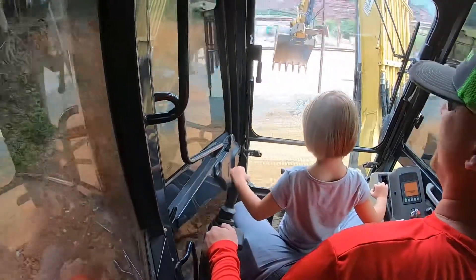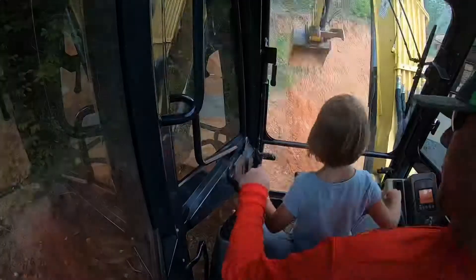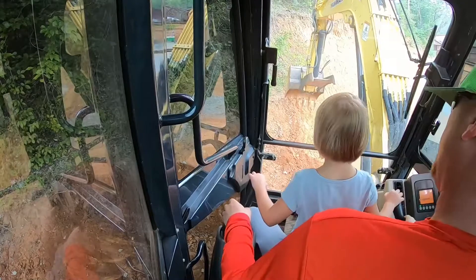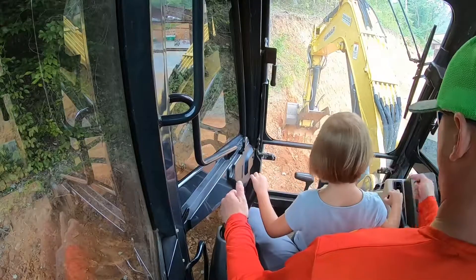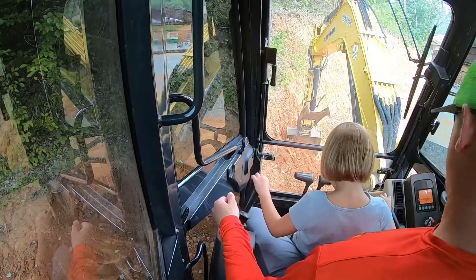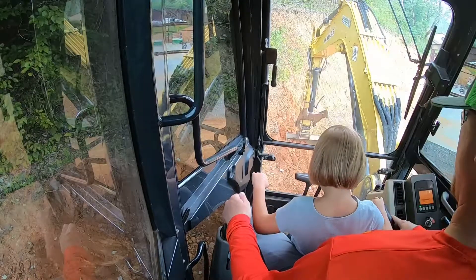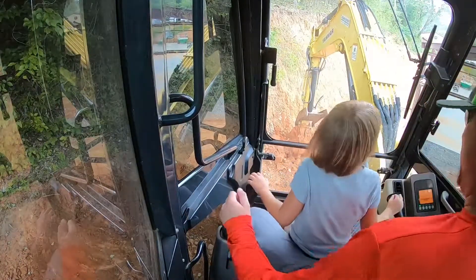All right, let's get another one. Push it all the way. You can go fast. There you go, don't be afraid of it. Push it all over and go back to where we just got the last bucket. Push this one forward to get down closer to the dirt. Push this one forward. Keep going — take the teeth into the dirt. Good, stop. Now curl your bucket by pulling that way. Keep going. See how it's digging? Good, good, good. Pull it some more. This is where your breakout force comes in. Good — now you've got a big bucket!